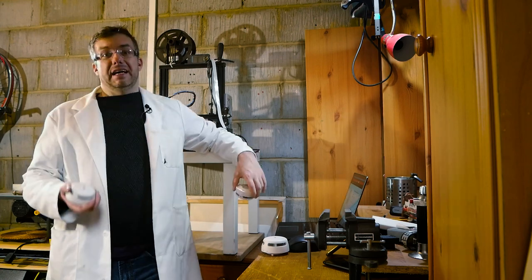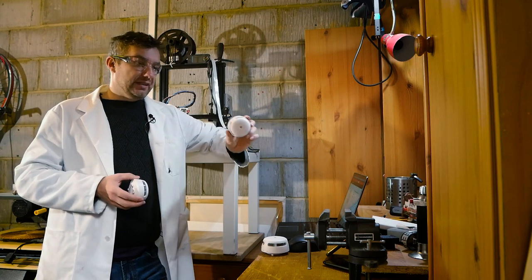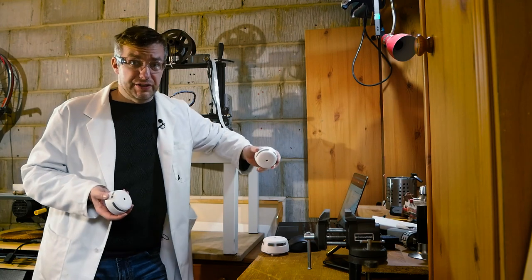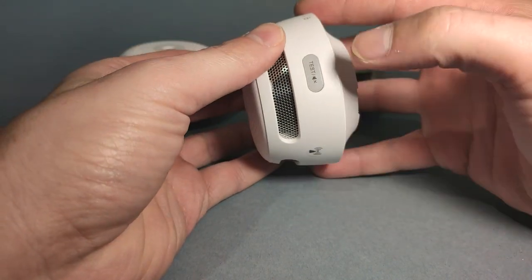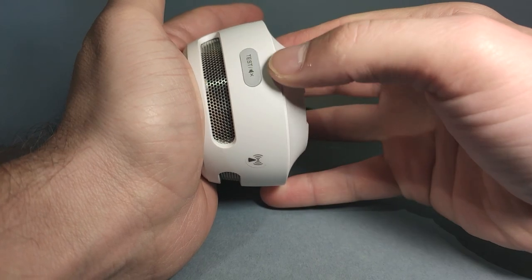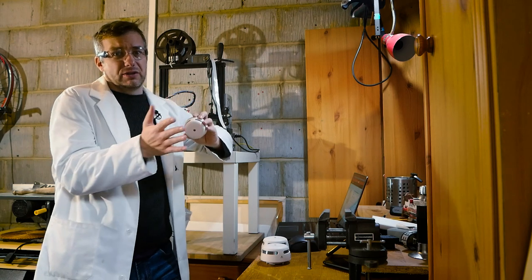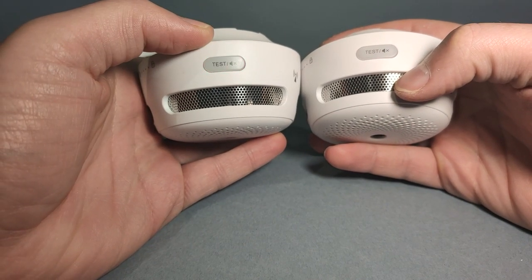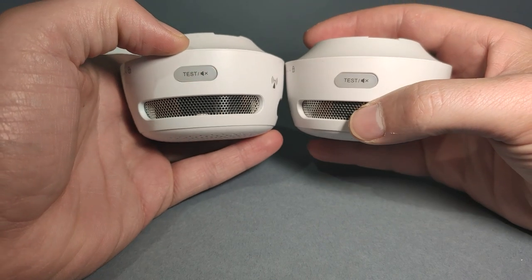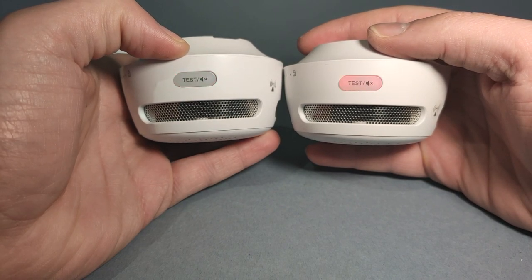So if anything happened in the garage, I would receive individual alarms on each unit placed at home — one permanently mounted in the kitchen and one in my office, because those are the rooms I consider high risk. Setting these up is incredibly simple. All you have to do is remove the tag to enable the battery. Before you start testing it, do yourself a favor and cover it with your hand to decrease the noise level. They're only 85 decibels, but enough to upset your ears. To link units together, press the button four times on one unit, then follow the same instructions on the second one, and within a couple of seconds they're powered up. I managed to pair all three units within a minute.